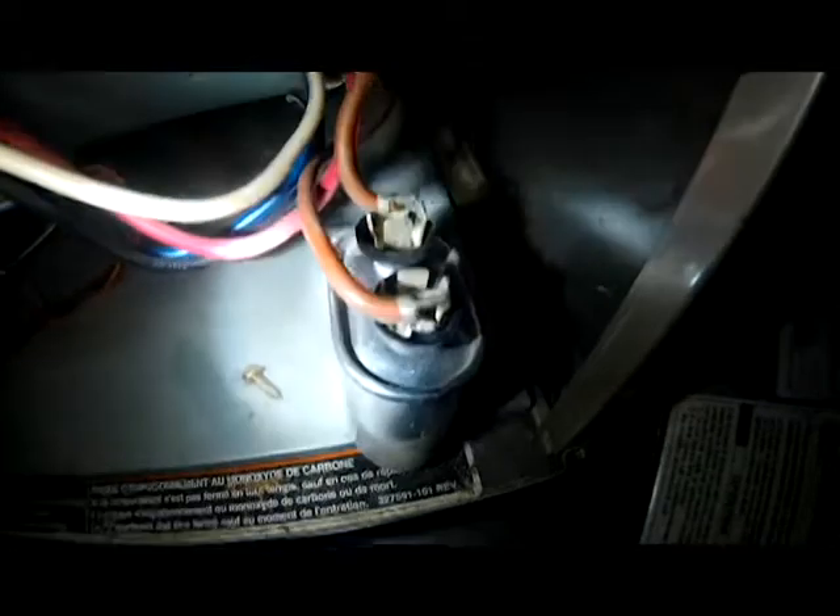The first thing I'm going to do is feel my blower — my blower is extremely hot, you could fry bacon on it. So the first thing I'm going to check is my capacitor. If our capacitor is bad, it will not turn our motor on, it won't start, and it will actually cause that motor to overheat. You can actually see on the top of this capacitor it's ovalled out — that's a clear indication that our capacitor is bad, but let's check it with our meter just to verify it.